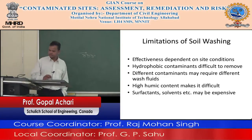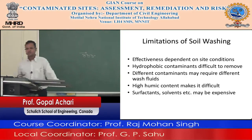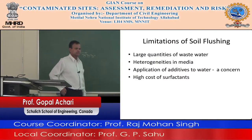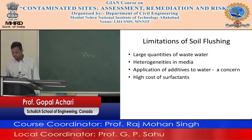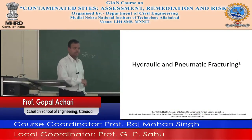Limitations of soil flushing: it requires large quantities of wastewater. There will be heterogeneities in media. You know, you've got this subsurface, there is a clay lens, the water will start to go around the clay. You'll never get the stuff that is in the clay. If you add additives to the water, it is always a concern, because you need to know what is the fate of these additives in the subsurface, and of course the cost of surfactants. Okay, are you clear about this part?